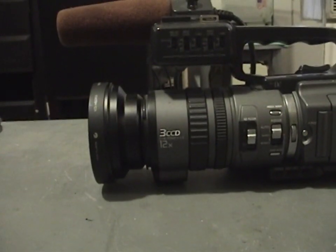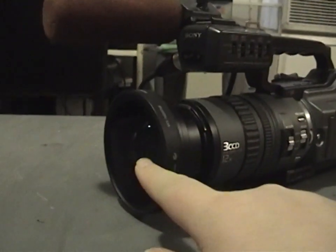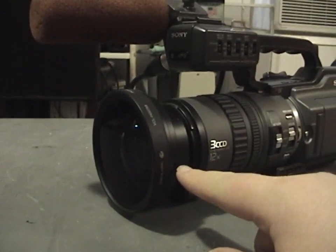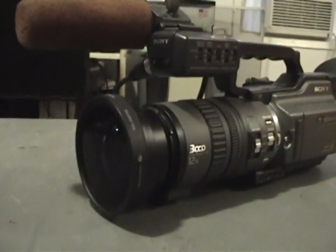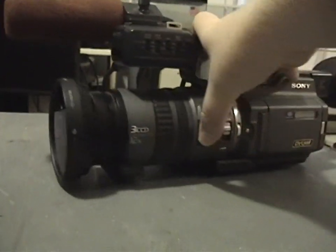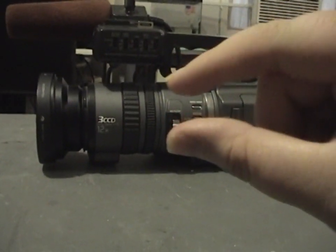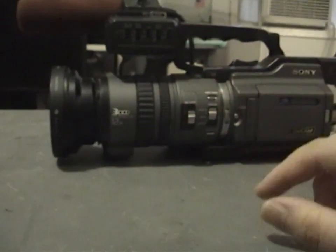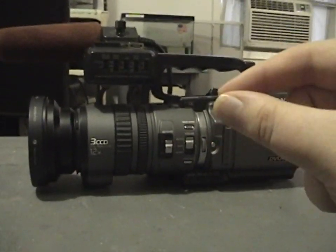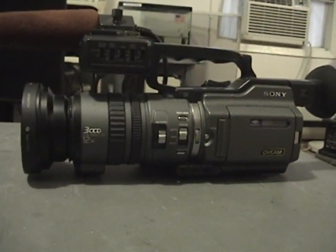There's three of them with a prism used such that when the light comes in through the lens, the prism splits it up into its separate red, green, and blue components, and there is a dedicated CCD for each of red, green, and blue, and that gets you way higher video quality. The reason for this is that CCDs are sometimes quite little, but it's a wafer arranged in pixels. But unlike an LCD display or some other flat panel display where there's three subpixels for each pixel, red, green, and blue, CCDs don't work that way. You can't have subpixels per pixel.